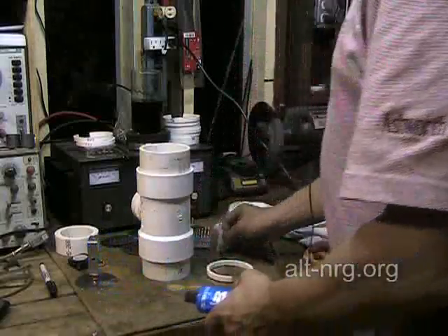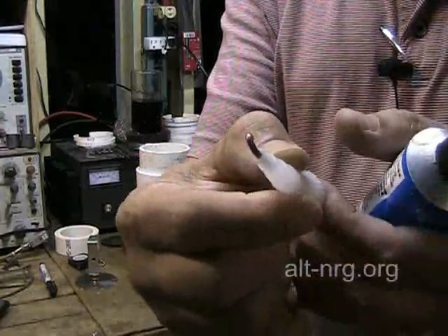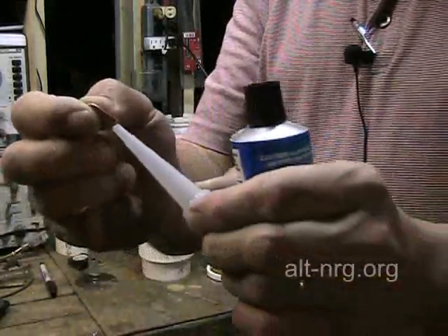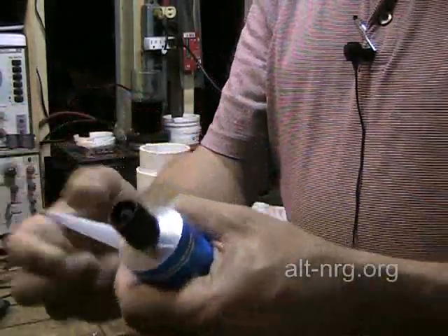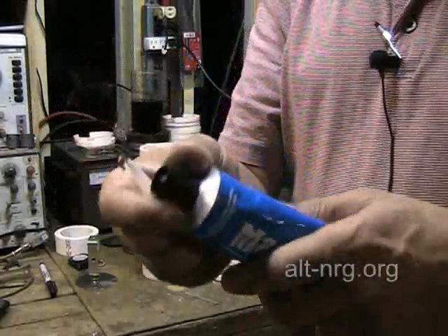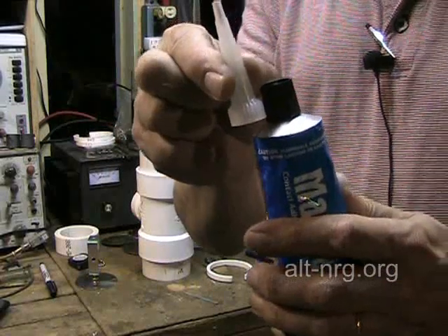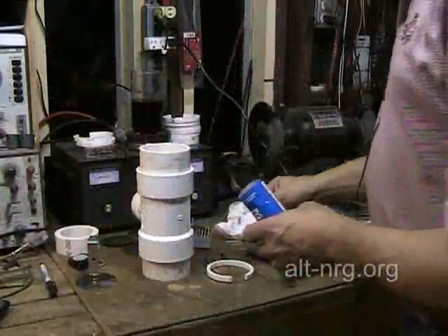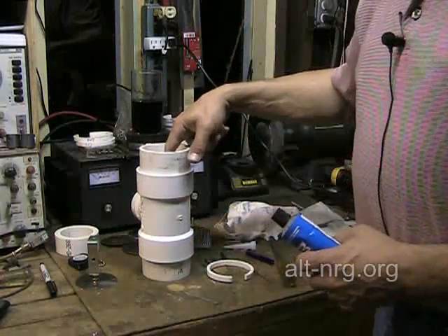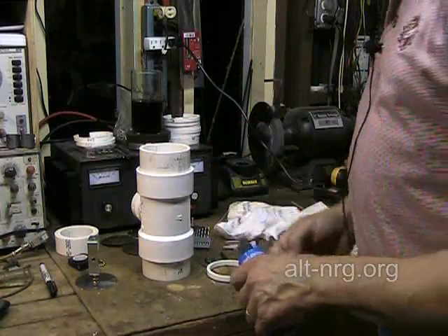The other thing is the 3M Marine Adhesive had a nice little applicator nozzle with a small opening that allowed me to put a nice small bead on my work. Goop Marine Adhesive tubes do not come with that applicator nozzle, and the 3M nozzle doesn't fit. So the degree of difficulty in applying adhesive going around inside the opening of my inverted T-cell has just increased exponentially.